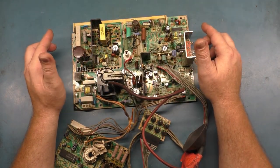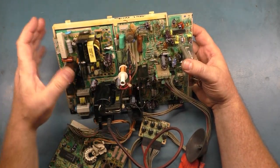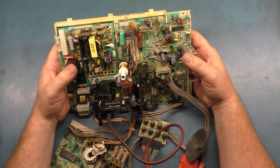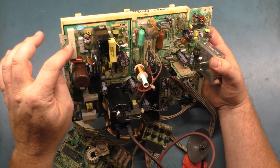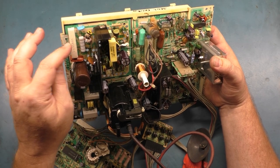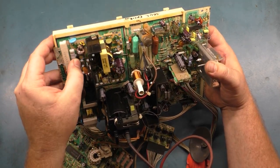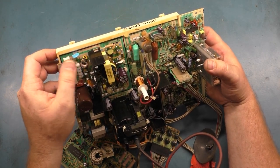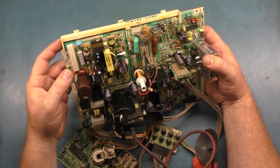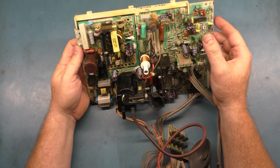So we need to do our light bulb test first and verify we have a good power supply. And if we do, we can proceed from there. Of course, if you recall, the R104 was bad. R104 was open for all intents and purposes. And then which one was this? I don't know what resistor this is. R105 was missing. Now, again, I don't know if it's supposed to be there because of this diode mod, but I don't think it'll hurt it to have it installed.